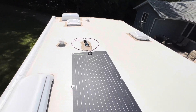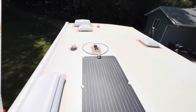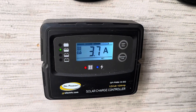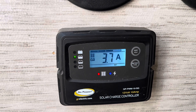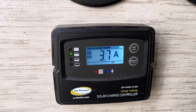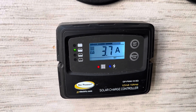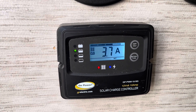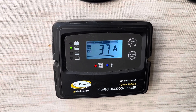Let's go in — it's a little after 11 with full sun. We've fully installed it and we're getting 3.7 amps at 12.6 volts, which is barely over 45 watts from a 100-watt panel. It's just a cheap one from Amazon but installed really easily, and hopefully this will keep our battery topped off while we're at the racetrack. Hope you enjoyed this video — like and subscribe and we'll see you in the next one. Thanks!